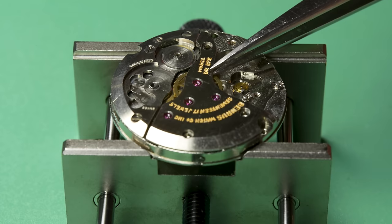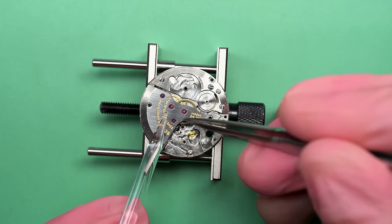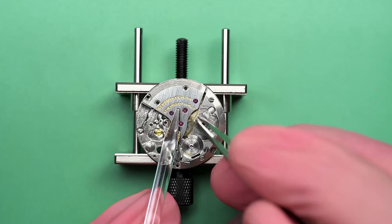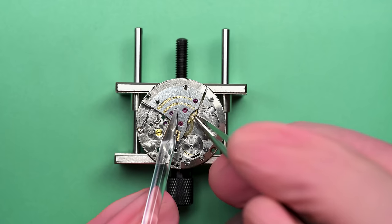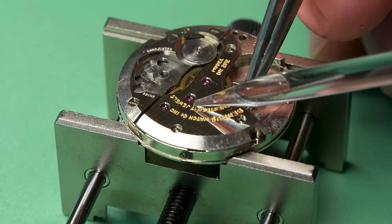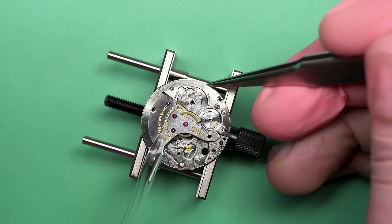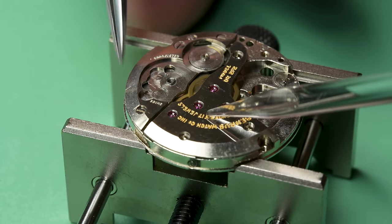As you can see, this train wheel bridge actually has four jewels on it — each of them needs to line up with the pivot hole underneath. It's a bit of a tricky operation. Some watch movement designs only force you to do three for the train wheel bridge, but this one has the full four, which does make it tricky. This is definitely one of the harder parts about doing a watch. If you want to try it out, one of the kits at SutcliffeHanson actually has a watch movement you can practice on — putting on and taking off the train wheel bridge, getting all those lined up underneath.